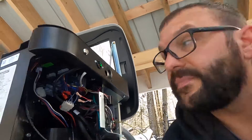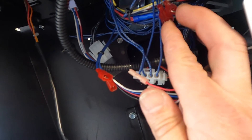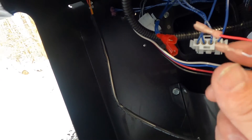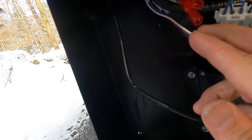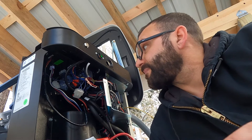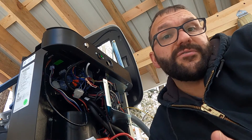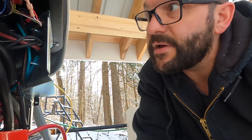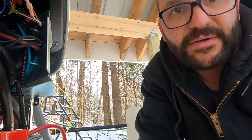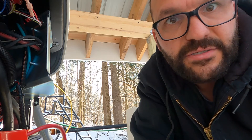As I said earlier, this Generac generator already has the two wires ready for the auto-start. On this one there are two sets of wires, but it came with the lugs you need to connect — use the ones that already have the lugs. It's a normally open system, so all you really have to do is touch those two wires; it takes about five or six seconds and the generator automatically starts. Remember, always have a licensed electrician or Generac generator installer do this for you.